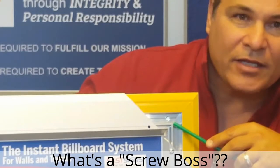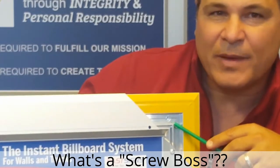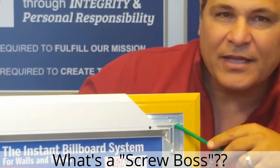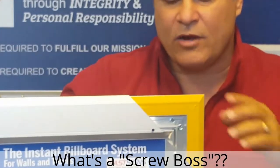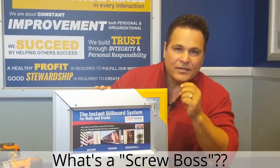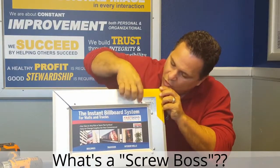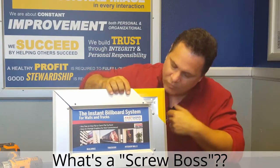What it is, is a channel. In the way we've designed our extrusion, the channel is a sleeve — it's about a half inch deep and it's a little bit more narrow than the screws that go into it. So it's not threaded — it's just sort of a sleeve, but the screw that goes through this hole drops down into this channel right here.